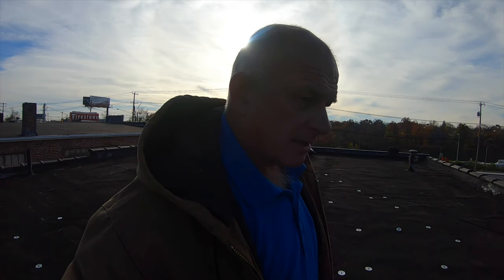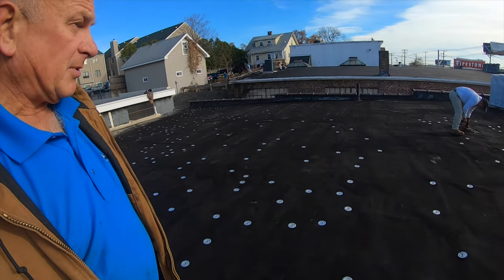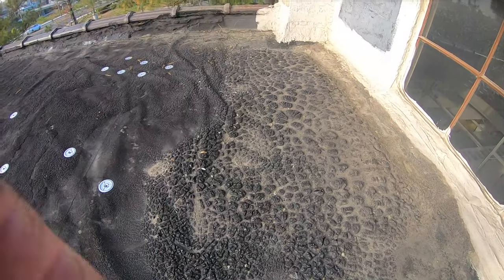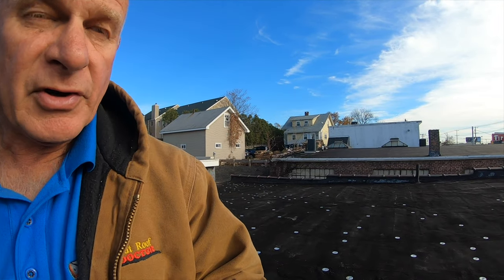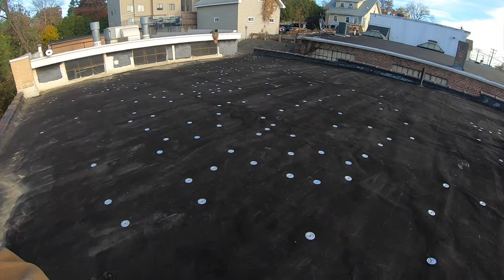So this is an hour later, and we got the roof clean, and we barely got the materials delivered. Now it's a matter of getting started. It's rough. You see the roughness here? That doesn't matter too much. All right. So you can go over almost anything. This two-ply system, oh, let me explain to you. The two-ply system only works on a slanted roof. You cannot put it on a flat roof. This roof is slightly slanted. Want to see?